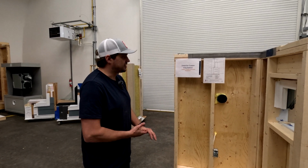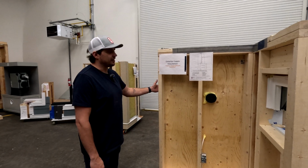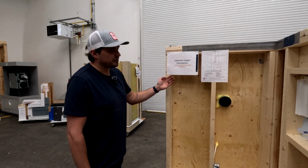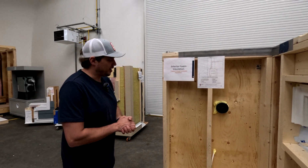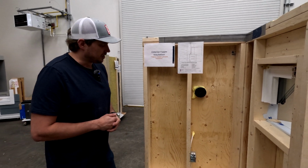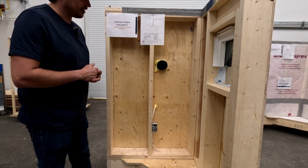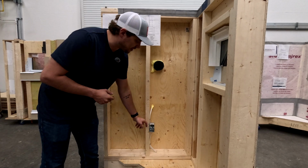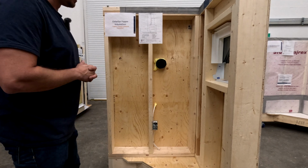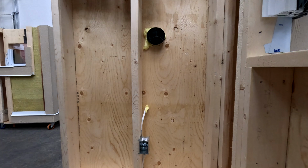To the interior of this 2x6 with exterior XPS, we mentioned earlier that the XPS to the exterior is now our vapor barrier. We do not need to have a membrane on the interior of this wall to be the vapor barrier, so it can be left open, and this wall essentially becomes a service cavity. The benefit of that is that any of our electrical boxes or penetrations to the interior side of this wall, we don't have to use special electrical boxes that can be sealed and things like that. It's just like doing electrical or HVAC on an interior wall.